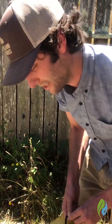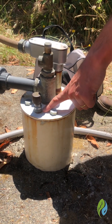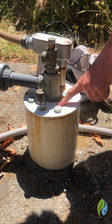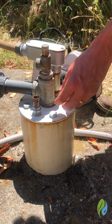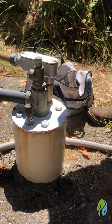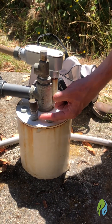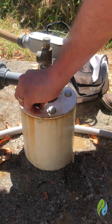So we can take a measurement. This one has the four bolts that secure the wellhead and it has a sampling port. Most wells are equipped with a sampling port with some variety of ways that it's plugged. This one is a vented sampling port with a copper vent and a threaded fitting in the port. Others will have a plastic threaded fitting port, others will be metal — there's a variety of these. It's essentially the sampling port, offset generally from where the electrical goes through to the well pump.